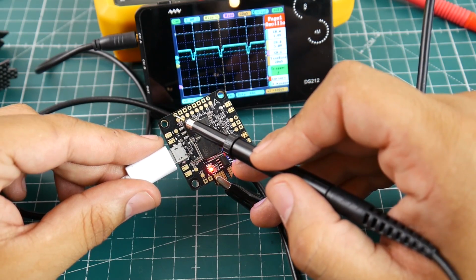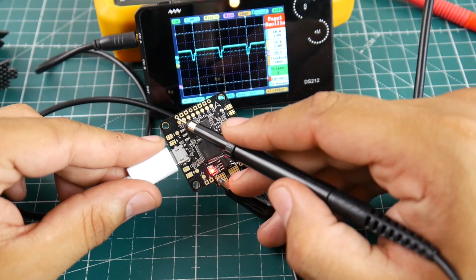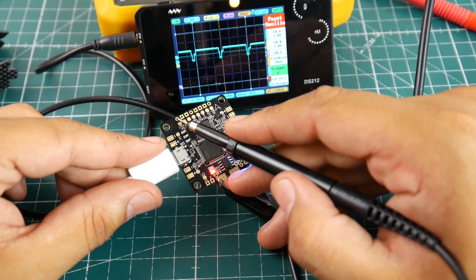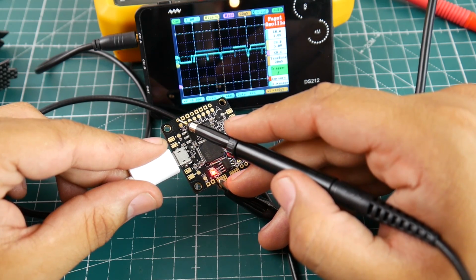And I forgot what they were called. I truly did study the signal completely, but I just haven't seen it in a while. But yeah, that's perfect. Each one of those dips is the start of a half frame. So NTSC or PAL, they're both the same, just their size is a little bit different. I do have a video that goes really in depth with my big oscilloscope if you're curious. Or I might just redo another one if you guys want to see an updated version of that stuff.